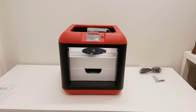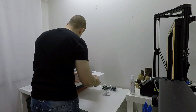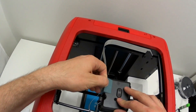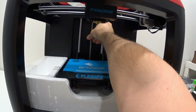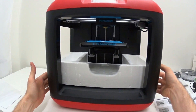There is a quick start guide and it was very easy to follow the steps. To release the print head, you need to cut the two cable ties on each side, and be careful when taking off the tape from the extruder flex cable because it's holding very strong. To remove the last piece of protecting foam, you need to lift the print platform — just use your fingers to lift it up and then slide it out.